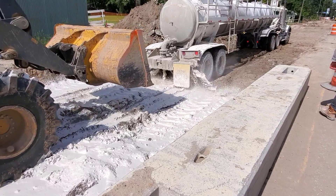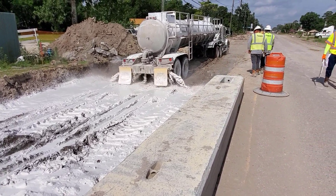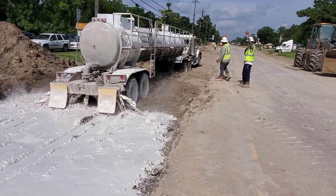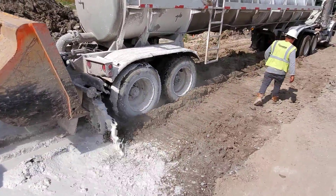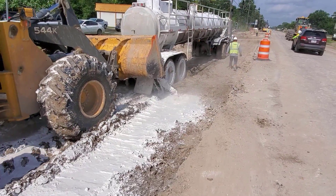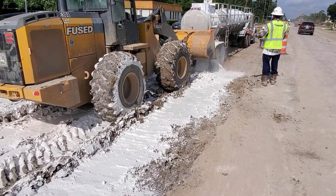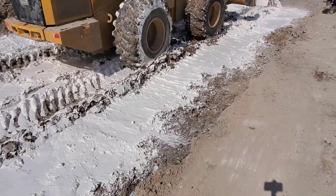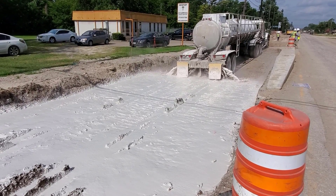Once the lime is down, mixed, and compacted, you can drive on it. The lime is made to repel water, which gives you a stable subgrade. This lime is very hot — well over 200 degrees, just short of boiling — and it's summertime at about 90 degrees outside. Look at all the steam coming off it. You don't want any lime on your clothing; it is corrosive and coming out of the truck it can cause third-degree burns.